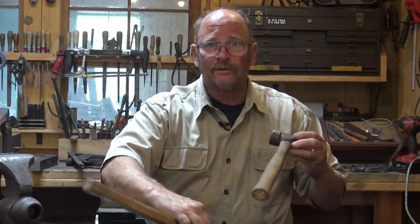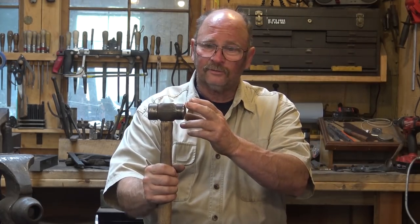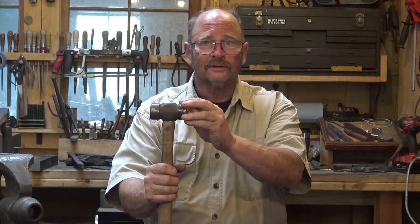So if you're looking for hammers and all you can afford is the common over-the-counter hammers that still have casting marks in them, they are perfectly suitable. Just spend a little time dressing the faces to make sure there's no rough spots and no sharp edges to ding your work — you'll be fine. As always, I hope that was useful. Give it a thumbs up and hit that subscribe button if you haven't done that already. I hope you can get out to your shop, make something, stay safe, wear your safety glasses, and we will see you for the next one.